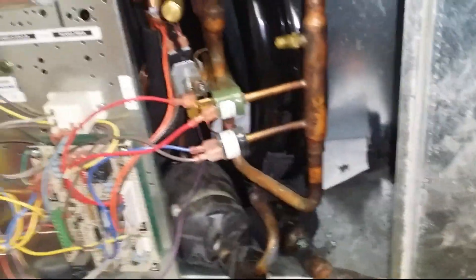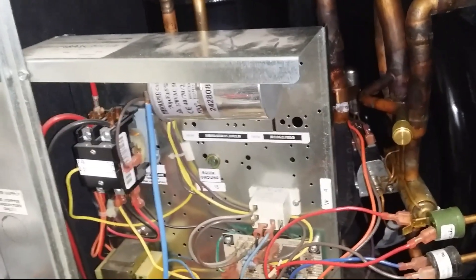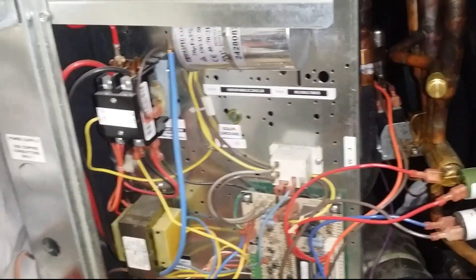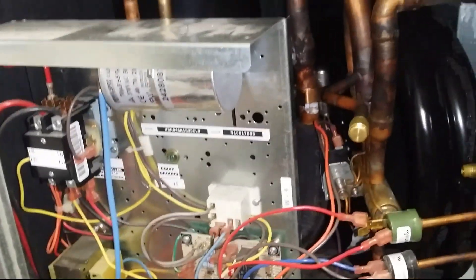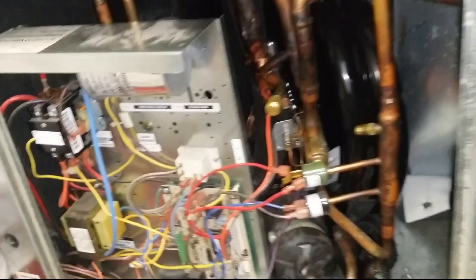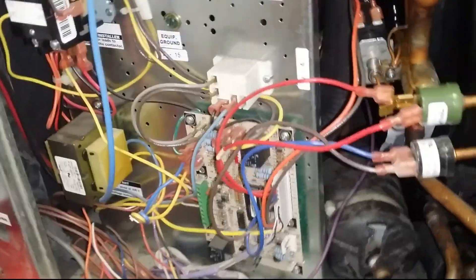Normally you would have a building that supplies water to the units. You'll have a cooling tower and a heat exchanger plate. But in some cases I've seen city water used on these units with a water regulating valve or pressure regulating valve, where you can reduce either the water flow coming in or coming out of the unit to stabilize your pressure. But in most cases you're going to see a cooling tower and a heat exchanger plate.